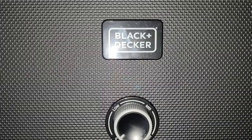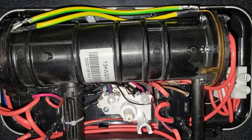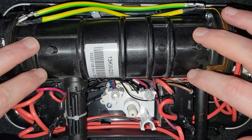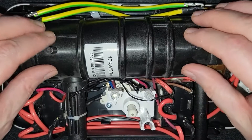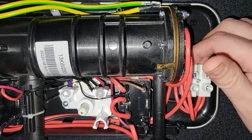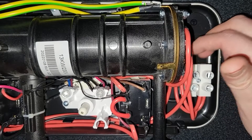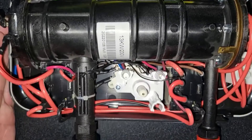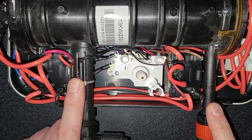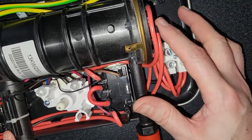There are some things you really have to be aware of before you tackle this project. Let me take this apart for a second. Okay, here's basically what we have. This is the water heater right here — it only heats this much water at any given time. This is where the 4-gauge cable goes, which comes from the 240 line to your electric panel, and then they pop out the top. Up here, this is your hot water that comes out, and this is your cold water in. There are reset buttons on the end of this right here, in case you ever have to reset the unit.